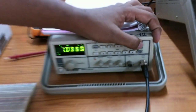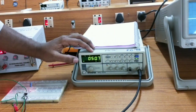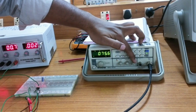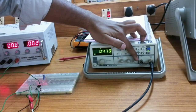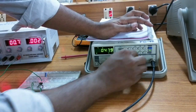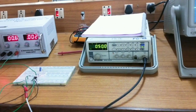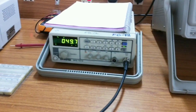Just to see, I am giving voltage now. What is the voltage now? 50 millivolt. If I need to get 100 millivolt, I have to vary this amplitude. So just 50 millivolt is enough for my experiment — around 50. One or two millivolt is not a problem. I have fixed 50 millivolt as the input signal to the IC.